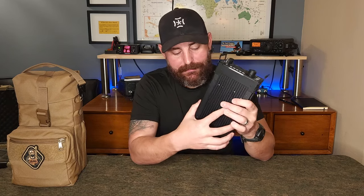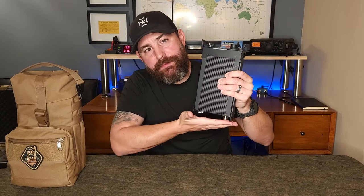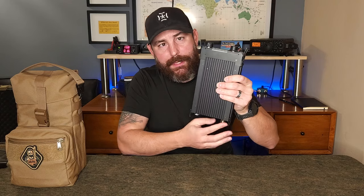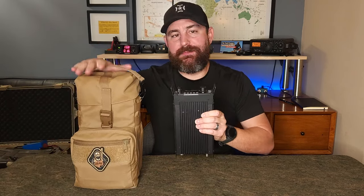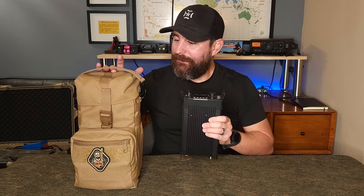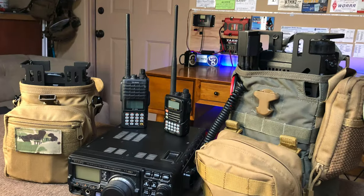This unit is a little bit larger than I thought. I thought it might fit into my smaller man pack, but you'll notice the connectors are almost flush with the bottom guards, so there's no room for a bend radius to accommodate the cables. This will roughly put it on the order of the same size as my Yaesu 857D man pack. It's unfortunate I'm no longer able to make these bags, but they were inspired by the PRC-117 golf pouch which is readily available. All the components I'm going to show you today are readily available, so this is a man pack you can build.